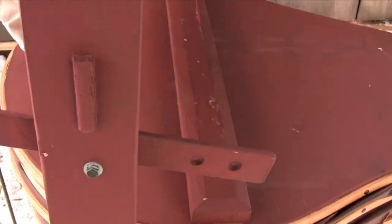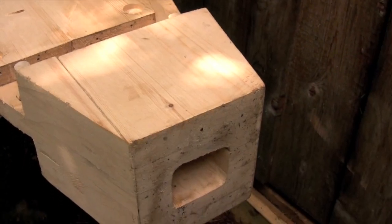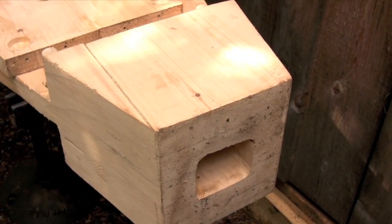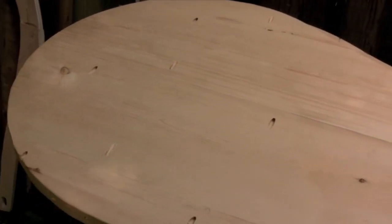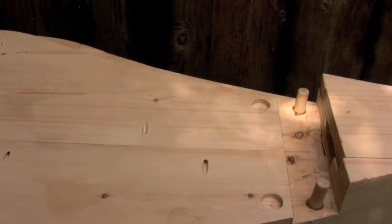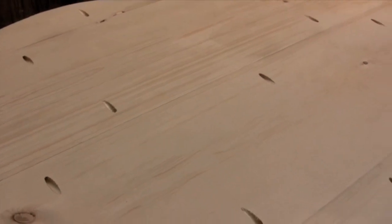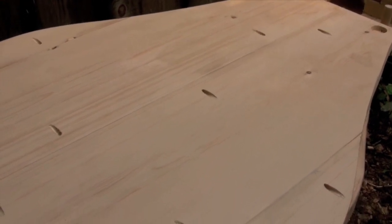In fact I've used this a few times now and it's much easier to set up than my hand crank blower. I use regular construction grade spruce lumber to build this bellows and I was able to get the entire bellows out of six two-by-ten by eight-foot boards. I milled the top and bottom boards down to an inch and a quarter thickness to get them as smooth as possible, and the center board I left the full inch and a half. I joined the edges and glued everything together in one step using pocket screws to hold the boards together until the glue dried, and that worked very well. I've made several bellows before, usually using plywood as the boards, and they just didn't work. I found that bellows have to be heavy to work properly and there's just no getting around that.